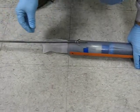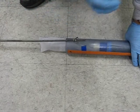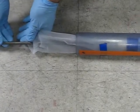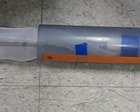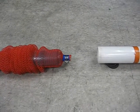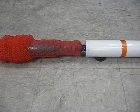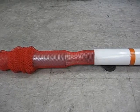We have the passive flux meter on the ground, ready to push it out of the Schedule 80 packing tube and into a 2-inch tube, simultaneously wrapping the red mesh around the outside. To push it out I'm using a push rod — a threaded rod with a wing nut — working it inside and pushing it right into the center tube at the top of the passive flux meter so I can extrude it from this tube. As I push the rod, you'll see the red mesh starts to wrap around and the PFM feeds right into the 2-inch tube.